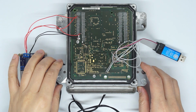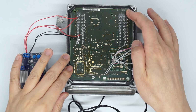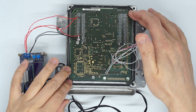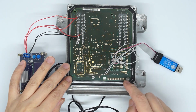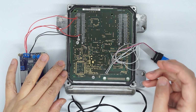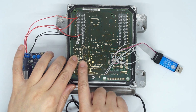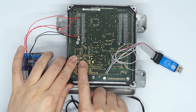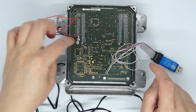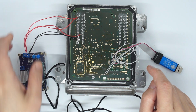This is another unit which has the U-Link connected. And by the way, this board is not destroyed. It's still sealed. This is still in the unit, and every component on the back is intact because it's also impossible to flip this over without destroying it. And we need a 100 ohm resistor here to pull the WP pin high to be able to erase and program the chip. The power is a ground here, and 3 wires need to be put to 12 volt.